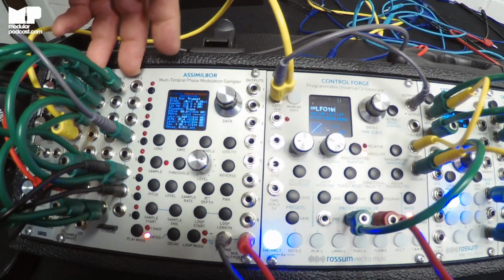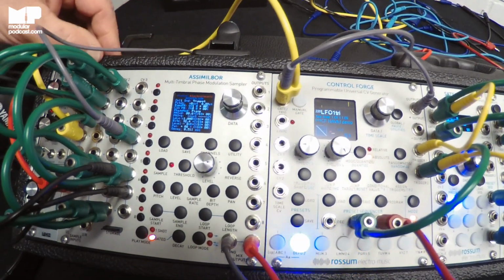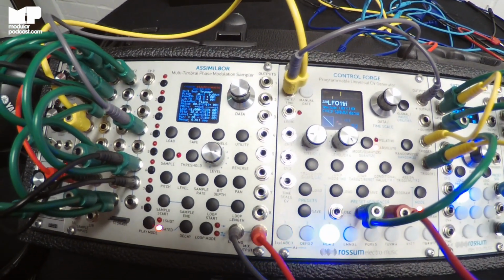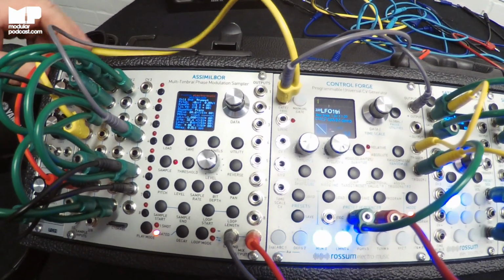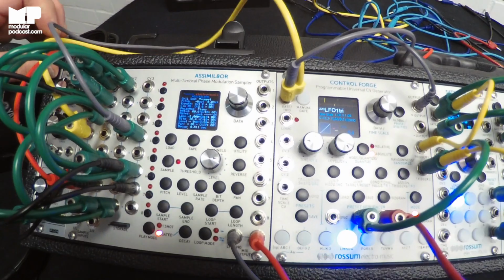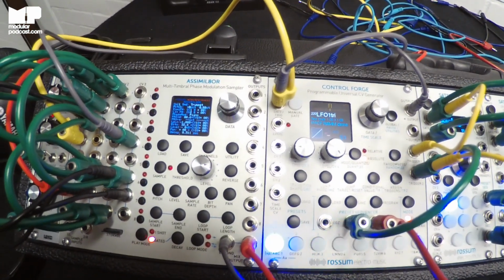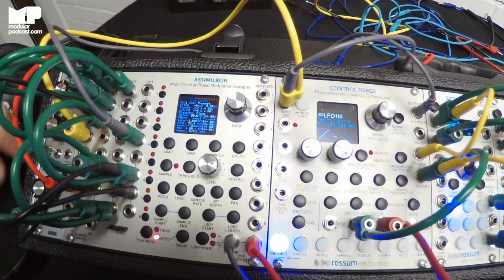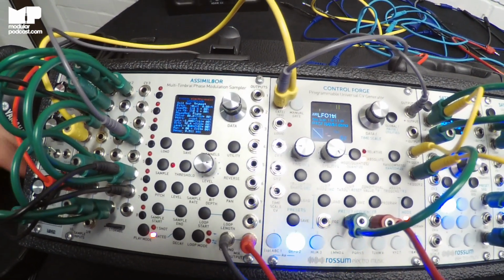You've got 3 control voltages coming into the module for each one of the sounds that you can play, and those 3 control voltages, each one can be routed independently with an attenuverter into any of the parameters. So you can really easily scale start time, pitch. Right, exactly, and have one control voltage have a certain effect on the bit depth and another effect on the modulation index and things like this. So you really get a lot of control. You'll be able to save that whole setup as a preset as well.